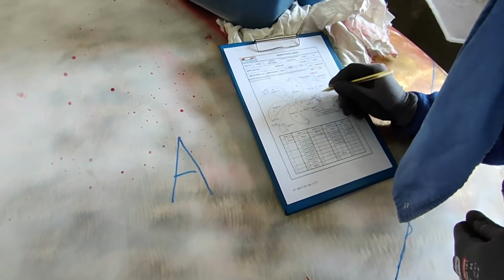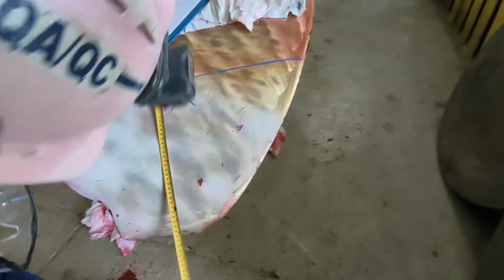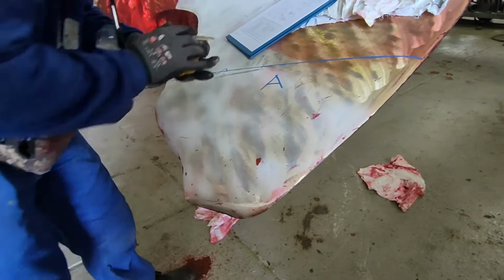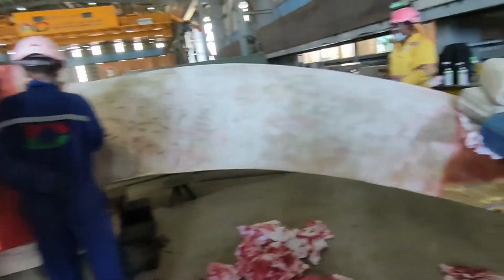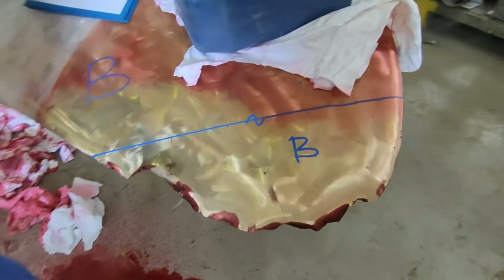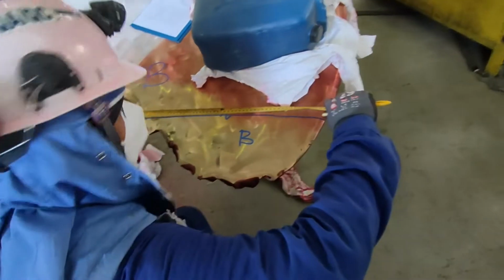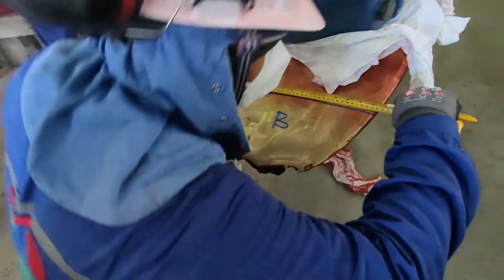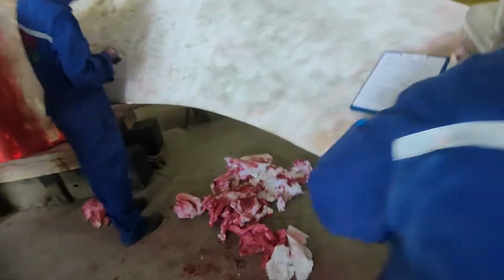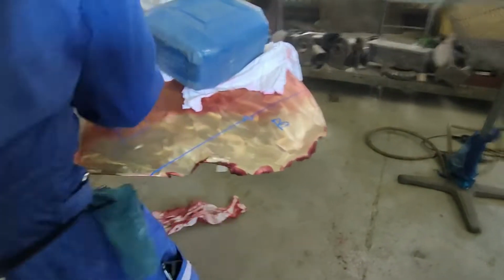Measurements are being carried out in order to confirm the length of the tip being cut. Repair will be carried out by build-up. They will ask for the expert to come in the dry dock to weld and build up the propeller until it reaches its original form.